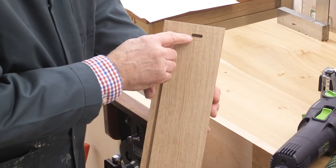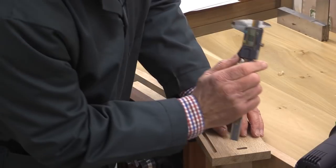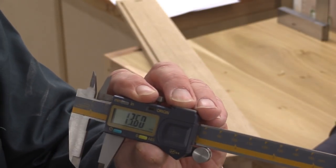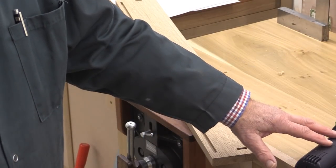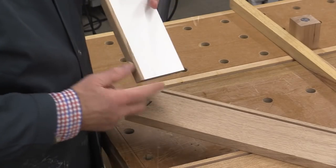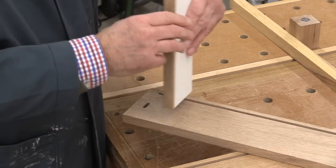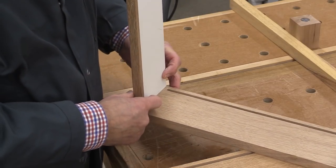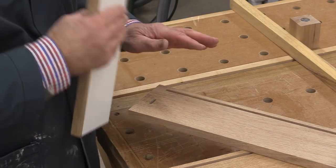There's that cut on that centre line. I'm just going to check the depth of this cut — it was set at 12mm and it's reading 13.6. That's why you have to be careful, because when you set the depth of cut on a domino machine there is always allowance for glue beneath the domino. I need to verify that the various markings are in the right place. I'm just going to check that my pencil line is in the centre of the domino I've already cut in the front. So I'm good to go with that one.